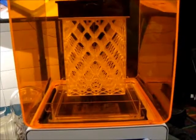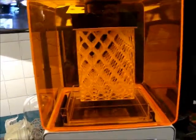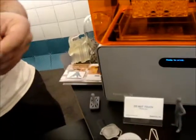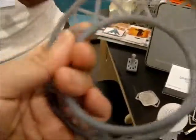We use a UV laser to cure a photo-activated polymer. And because we use a laser, you can get really fine surface finish — nice finish. If you handle one of these, you can see that you can barely see any of the layer stepping. Whereas most FDM machines, you can see and feel the layers. Wow, that is nice — very smooth.